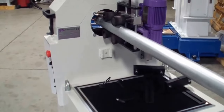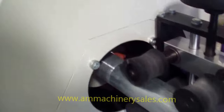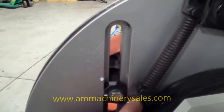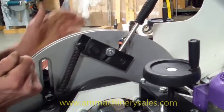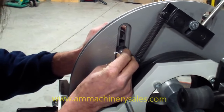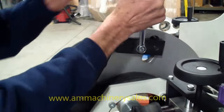Now we're going to show you how to set the machine up to process this tubing. This tubing is actually 55 millimeters in diameter. If we open the cover, there is a scale here that goes from 10 millimeters at the bottom all the way to 100 millimeters at the top. Release your tension and now you're able to move the adjuster to align it with the dimension mark that you need — in this case we're going for 55 millimeters. Lock your adjuster down.